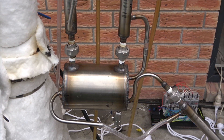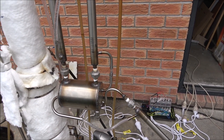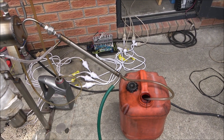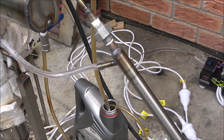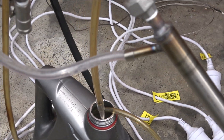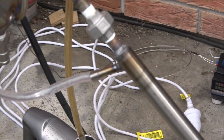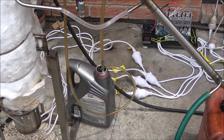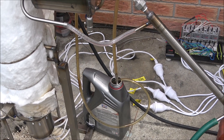The distillation works by filling up a cylinder with fractions by portions — when it's completely filled it goes down inside and releases a portion. I'm collecting it here. This container is for possible light fractions if any, but I don't see any right now. Light fractions are usually produced when running at high temperature — they're a by-product of destructive distillation.